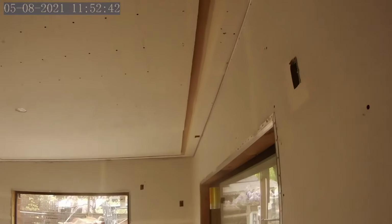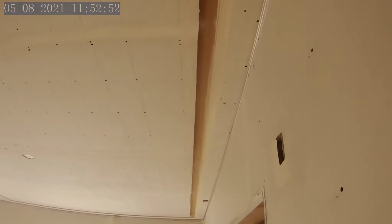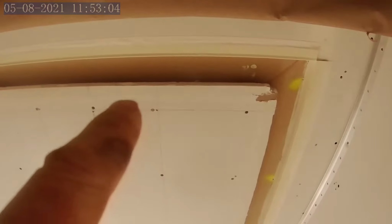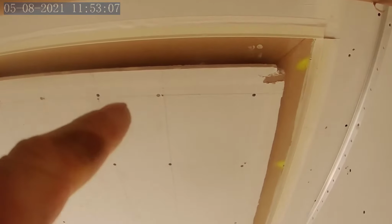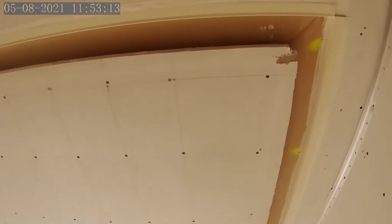They started working on the LED troughs yesterday and got really lovely straight lines. They had also done this side and on two of the sides of the square, and I actually had to rip it off because it's hard to see, but basically there is going to be an LED tape placed on this side, and that's actually an overhang by about 2 inches, 2.5 inches, and then there's a little gap between that and the top piece. And the idea was just to provide a little bit of an upstand, and the problem was that the product we used was too much of an upstand, and it completely blocked off that space.